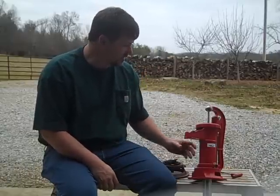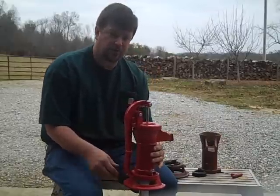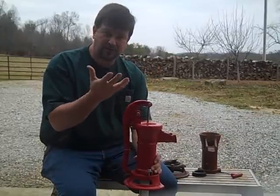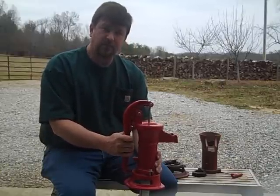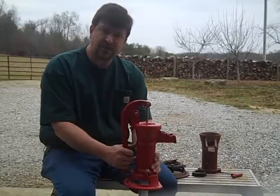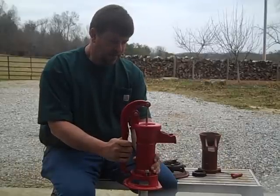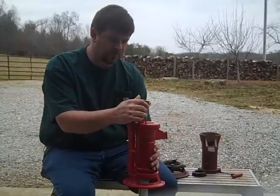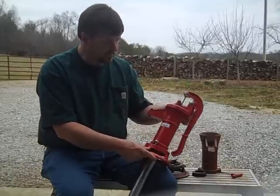Many of you are already familiar with these pitcher pumps. They rely on suction to pull the water up. You can't suck water or lift it more than around 30 feet. Theoretically, 34 feet is the max — one atmosphere times 2.31 gives you around 33 to 34 feet. Barring no inefficiencies, these pumps are rated for 25 feet, like this pump.